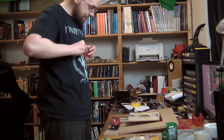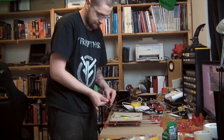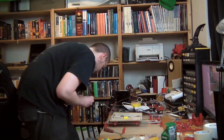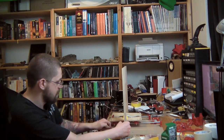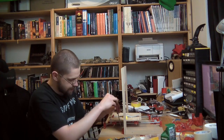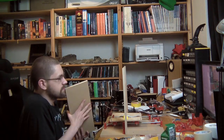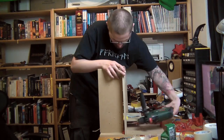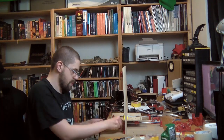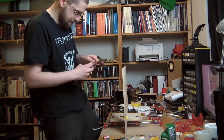Now I'm assembling the superstructure. The superstructure of this printer is made out of 5 sheets of 12mm MDF, held together by printed L-brackets. In my opinion, you should just buy L-brackets — it's going to be more stable, it's not really expensive, and printing them takes a lot of time because they're 95% solid. So by just buying them you save time and material while gaining stability.